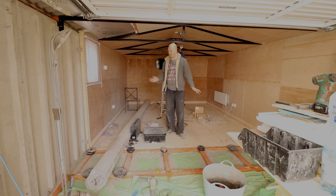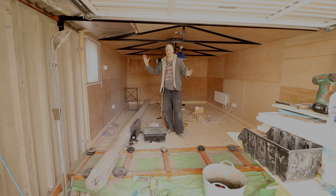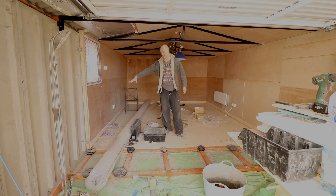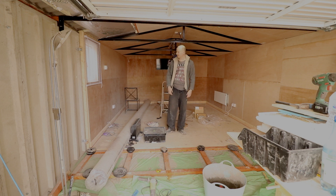The only thing I had a problem with is these panels. Basically, this garage was put in place of an old one that was taken down. They left the existing concrete floor and put a bit extra round the sides to make the garage wider. The concrete panels are on the wider parts. We're in the process of making sure it's levelled as possible. What I had to do, unfortunately, was grind some of the concrete away to try and get it levelled. So at the moment we've got this wooden frame floor where we're going to put some more plywood down, and I think we're getting there — it's looking quite decent now.